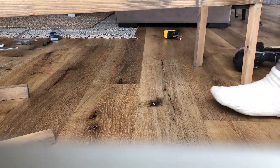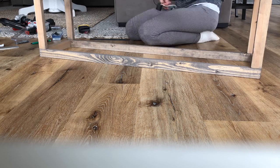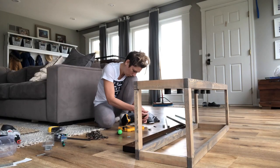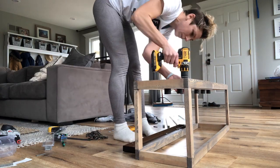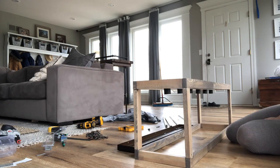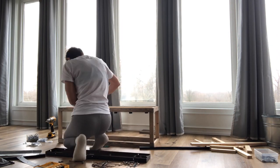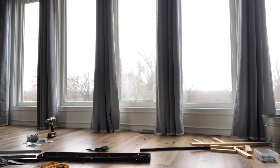I realized the strip of wood holding the light bulbs was not structurally strong enough to hold up the whole fixture, because on the sides where the holes were drilled it's very thin. So I reinforced it with another strip of wood on top, which actually worked out really well because it also hid the cords a little better. Here I am attaching that with some eye hook screws. The added piece made the light-holding board flush with the whole light fixture.